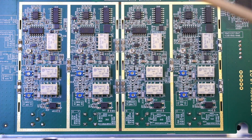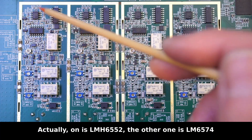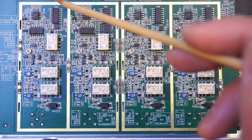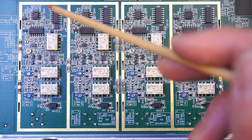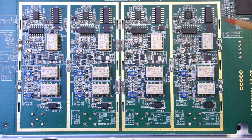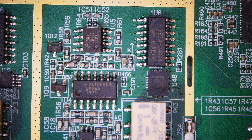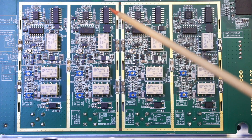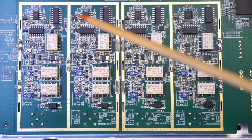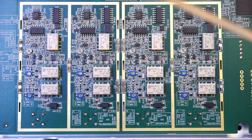On this side the ICs — I don't see any special ones. These two are the LMH 6517, which are high-speed op-amps. Interestingly they are identical in marking but in different package sizes — I wonder why. The one next to that is a 4094, which is a shift register, nothing special. We have two QFNs which are LTC 2620 — these are octal 12-bit DACs. My guess is they are used to control both channels and set some programmable gains for the op-amps.